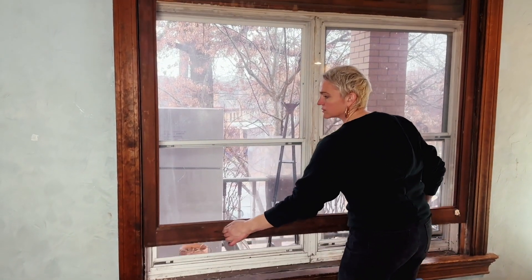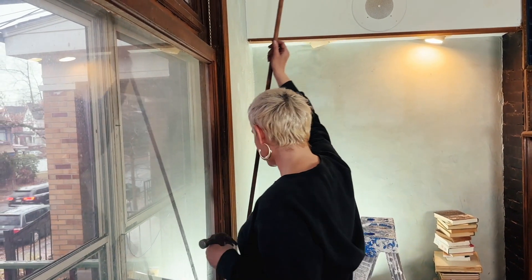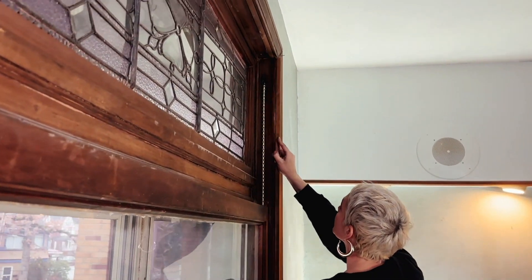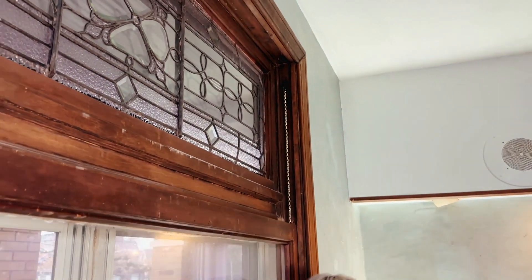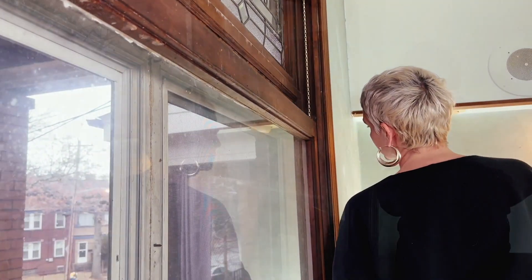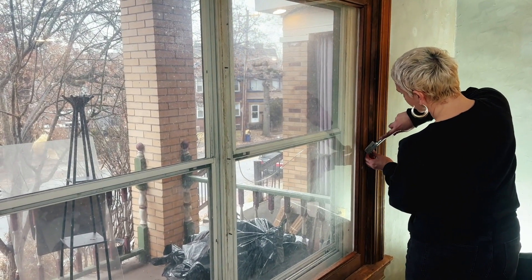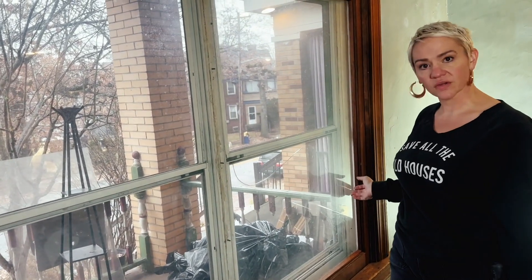Now that you have them chained, your spirals are in the divots, they're screwed in, everything's secured — go ahead and give it a test. Now we're going to put the interior stops back in. We're going to pop in our stops, put in a couple of finishing nails, and make sure it's not too tight against the window so it's not hindering it from going up and down, but close enough that it won't wallow back and forth. There we have it — a functioning window, new chains, new weather stripping, ready for the Pittsburgh winter.